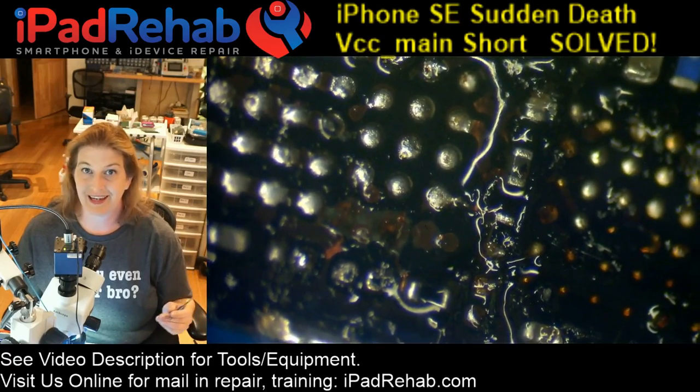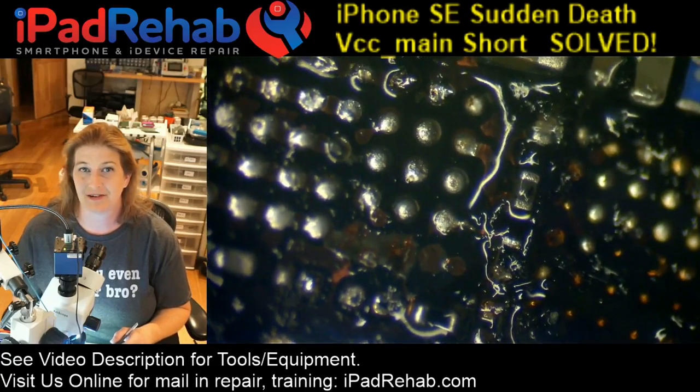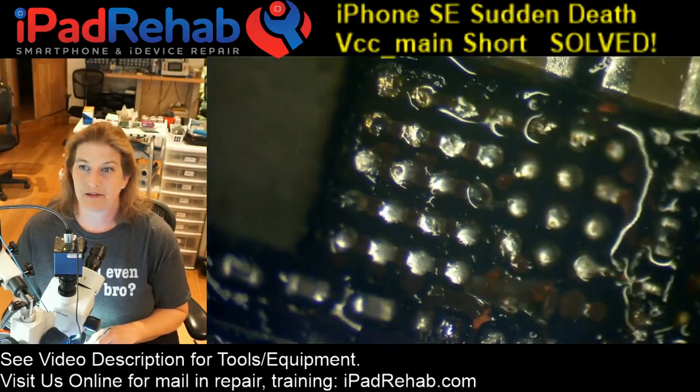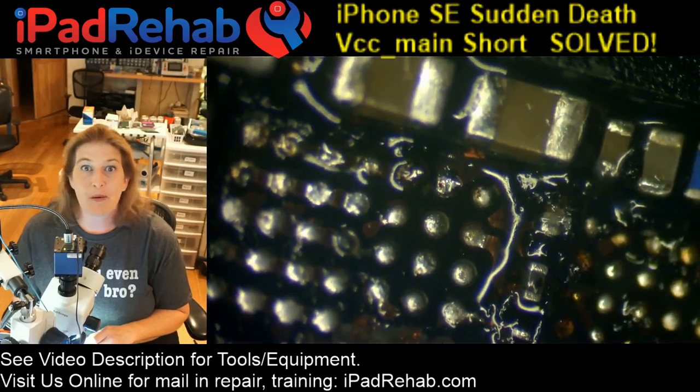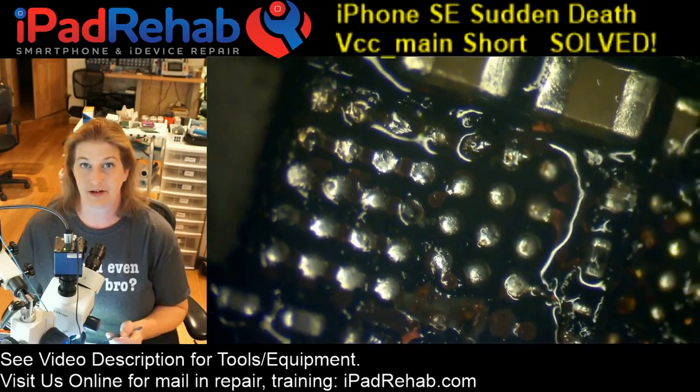So they gotta be there, and Tigris is required for boot. So we need to have a working Tigris just to be able to troubleshoot this phone. So this is a pretty big, massive repair. Here's the point. You don't wanna take off Tigris, you don't wanna take off TriStar unless you have a good reason.